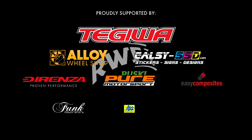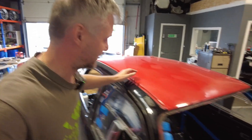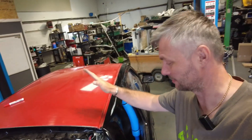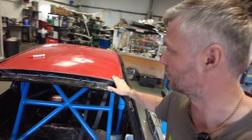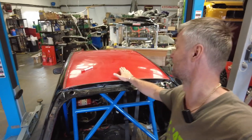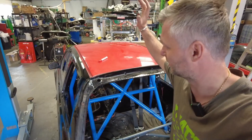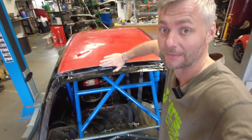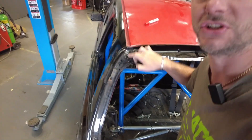The roof on the micro looks to be a very simple item. There are two seams running across — it's different to a clear roof where at the front it sort of flanges. It definitely requires a mold. Again, we're going to cut every single corner possible — skin it two layers, same as the wings and the bonnet, then flip around and reinforce in strategic places. It's fairly flat, so the fabric can go right around the back. You can actually see where the original roof is attached.